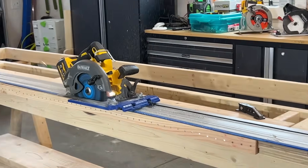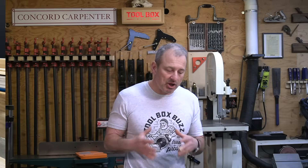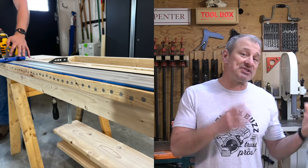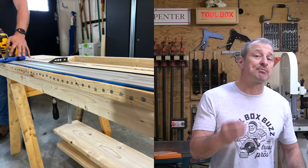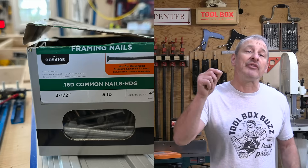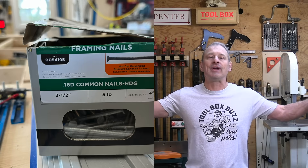So we designed a brutal eight-foot nail-embedded lumber rip cut. Three cuts per blade were performed using three new blades, and the time was averaged. For cutting material, we used an eight-foot two-by-ten KD with 16-penny nails embedded every inch. The material was pre-drilled along the center axis to prevent or reduce splitting. The nails were installed by hand, resulting in 94 nails over an eight-foot board.